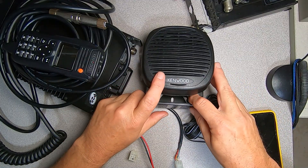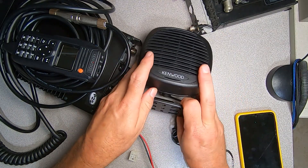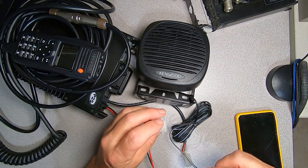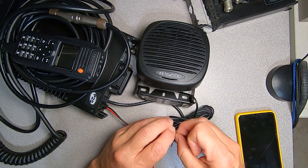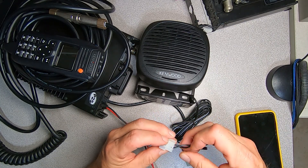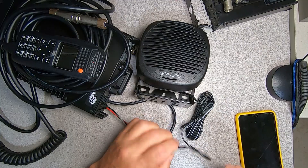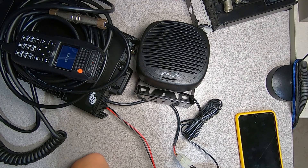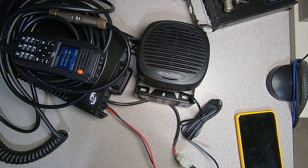Now let's pin out and install our remote speaker. This is the KES 5A speaker, which is a 40-watt, 4-ohm speaker. These are going to go to pins 2 and 6 on this connector here. Pin 2 is here and pin 6 is right here. After we've installed those pins, let's go ahead and plug it into our connector. And you can see that's only at half volume — so this is a much louder speaker option.